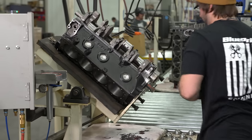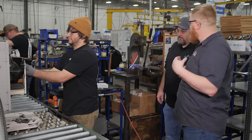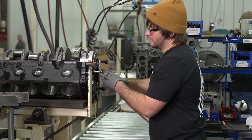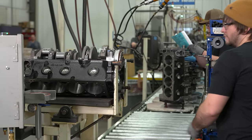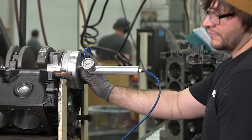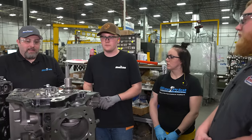The rest of his time is filled with putting the rear seal housing on, so it allows for multiple tasks at one station. He then uses an air check tool to pressure-test the rear seal right here to make sure it's not going to leak. Our last line of defense is our dynos, but we'd like to catch leaks before that because of the effort that goes into building the engine before it gets to the dyno. He puts the test gauge up, gets a pressure reading, and as long as he meets that mark it can move on to the next station.